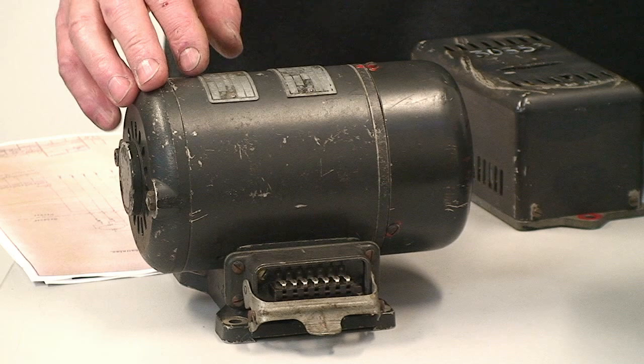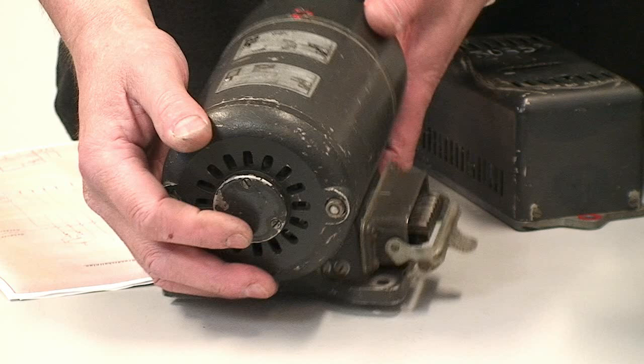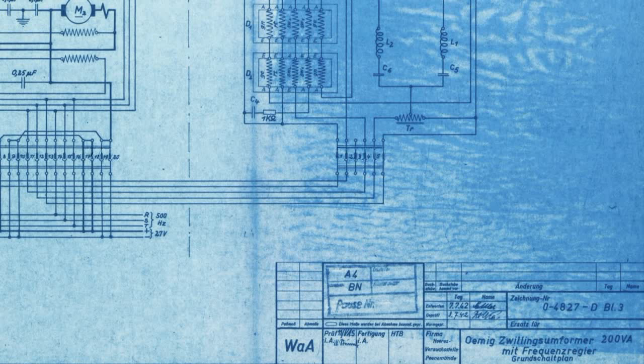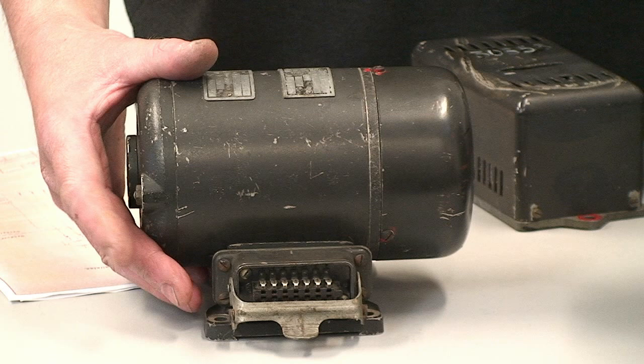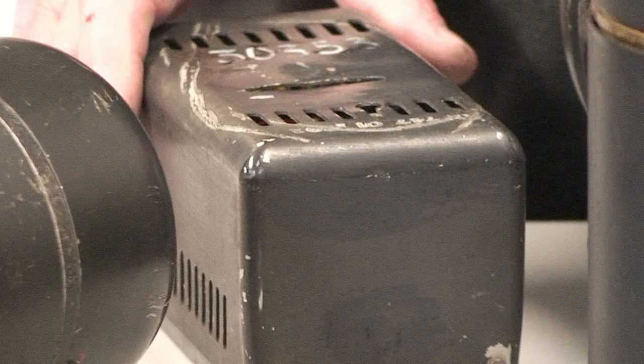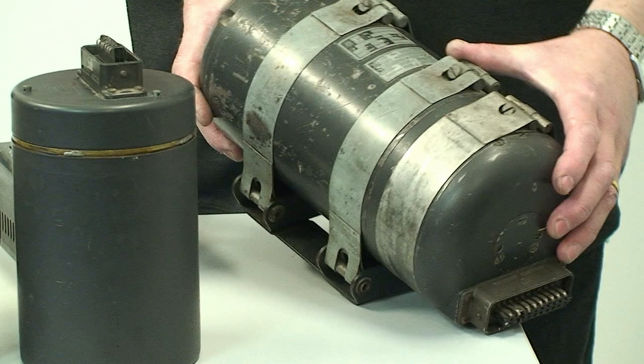One of the first components we've got here is an inverter system. This runs on 27V DC current and produces 40V multi-phase — actually three-phase — operating at 500 cycles. This is manufactured by the electrical producer Alfred Ohmig, often referred to by the engineers working on the V2 simply as an Ohmig. When this went wrong, they would talk about simply replacing an Ohmig. So that's this Umformer, this transformer device. At one end we've got a DC motor system, and at the other end we've got an AC dynamo. This is the regulator, a frequency regulator — so these two components belong together.